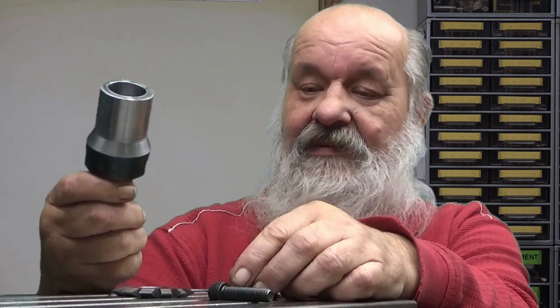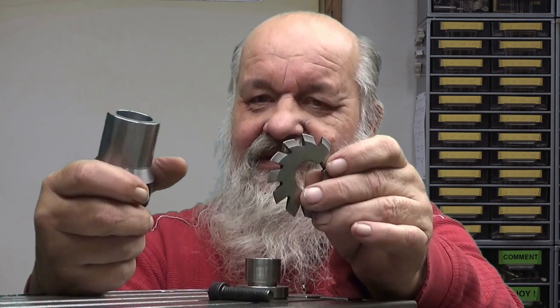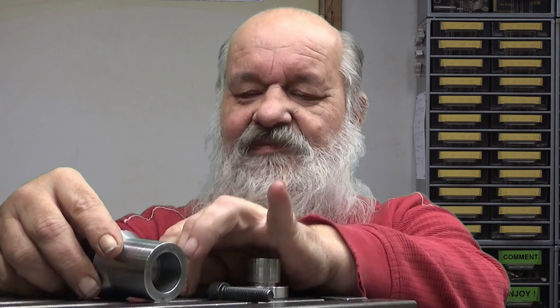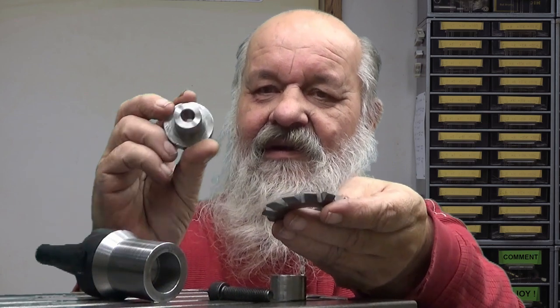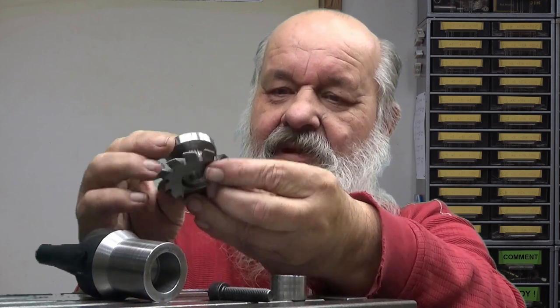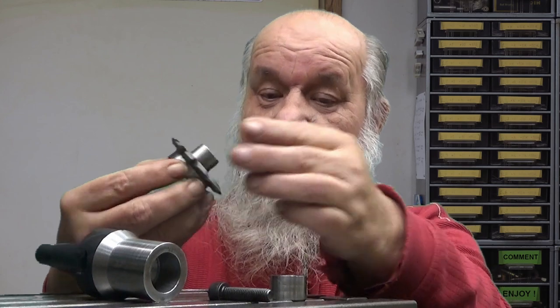Well, I made a thing like this. And this one is a mandrel, or mandrel? It's a thing where you can attach these teeth, these cutters. And now you need to take into account the rotation direction here. I will explain why. First of all, the system is such that this here is exactly a match with that hole. And of course I put it the correct way because I know. And there it is. It's quite concentric.